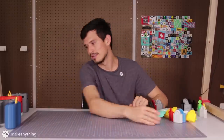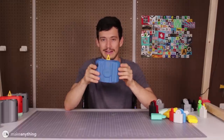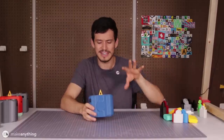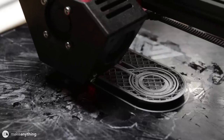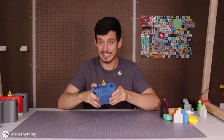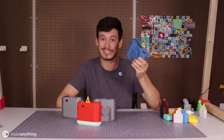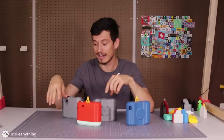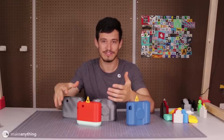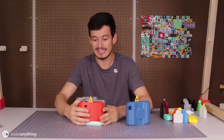But — puzzle box. This is the actual end result I wanted. Something that's mysterious and weird and has several things going on that you really have to fiddle around with to figure out. All of these puzzles definitely helped me figure out tolerances for printing in place. I found that a 0.4 millimeter gap between separate parts was about as tight as I wanted, so this could be printed on just about any pretty good printer. Still, this has a lot of different things going on, so I did have to print four versions until I finally got one that works. I just took this off the printer — I actually haven't tried it yet. I had three versions before that weren't quite right, and with each one I learned what was wrong and made changes. Iterative design — it's how all design becomes great, and it's why 3D printing is awesome, because it allowed me to do this in a couple of days instead of months.